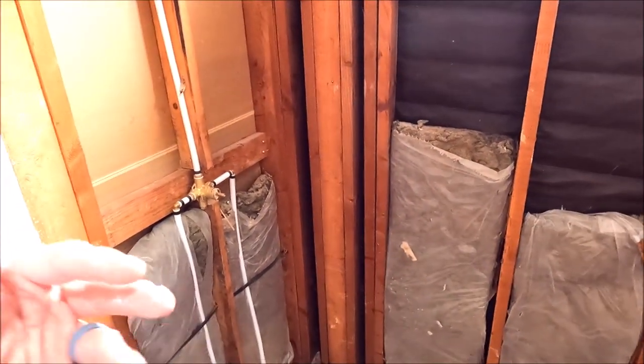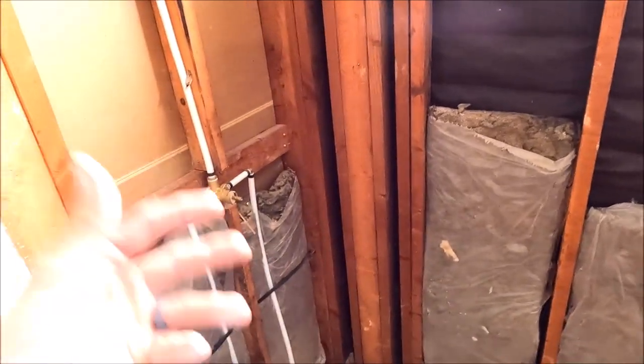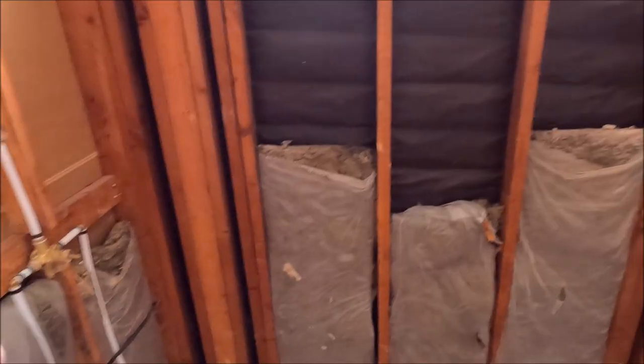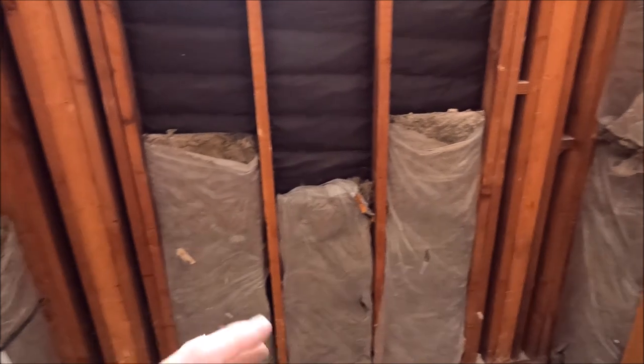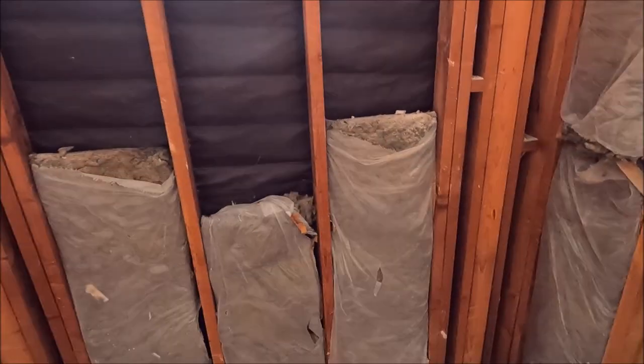There's a small gap in the middle stud, so we have at least six studs to address in order to obtain our flat and plumb wall so that tile installation is quick and easy. If you do not address walls that are out of plumb or not flat, you will get a terrible tile installation job, or it'll take a very long time because you'll have to adjust every single tile to achieve flat and plumb walls.